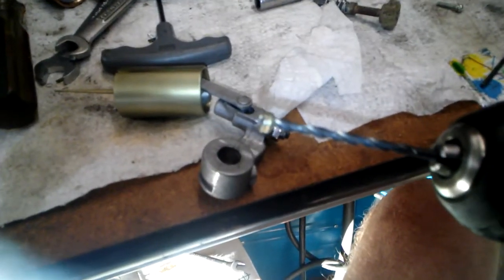Alright, I had two of these I had to drill out. So I find a drill bit that's basically the same size as the bolt, just a little bit bigger. Once it gets down to the bolt it pops the head off. I had to do that to two of these, and this thing will come apart now.